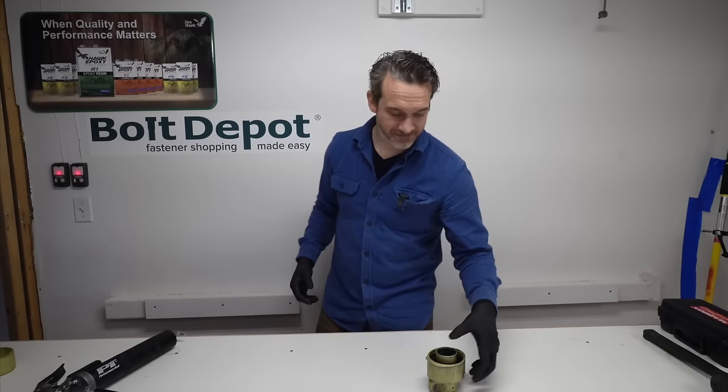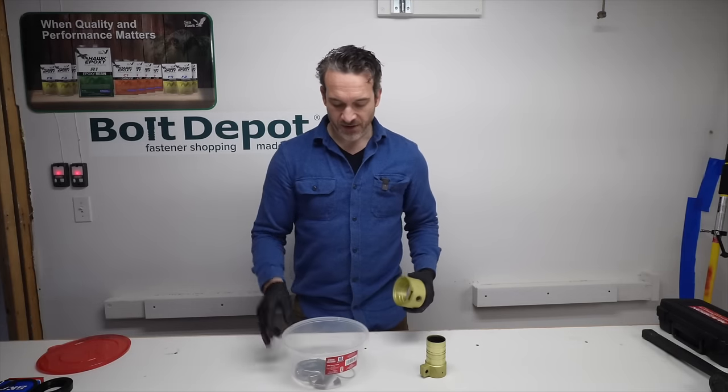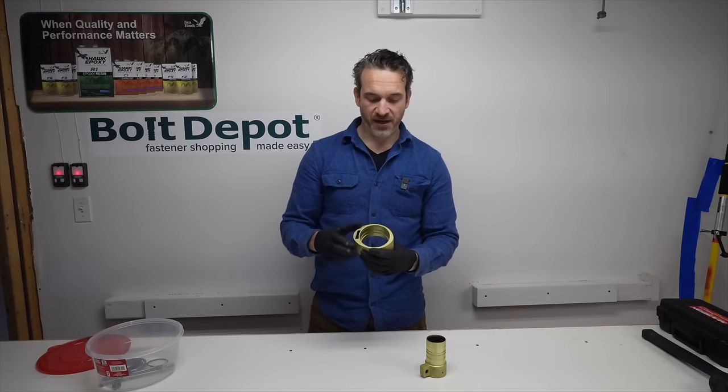We'll be replacing all the internal parts on these furlers — I'll put the details in the description below. I will say that you're going to want to use carbon steel bearings, even though that seems totally counterintuitive. Pro Furl has documented that stainless bearings deform under the loads needed and just don't work properly. A carbon steel bearing still works well. Now, apparently the original oil seals had stainless steel springs, and I don't really understand why a stainless steel spring is necessary when you have a plain carbon steel bearing inside — when water gets in, it's all going to rust. But if you've got stainless springs in your oil seals, great — use them.